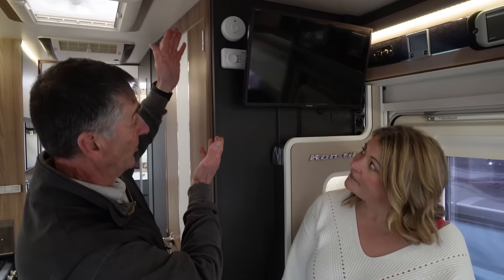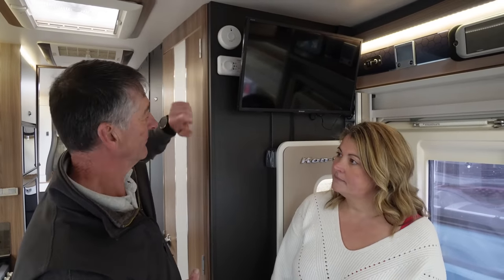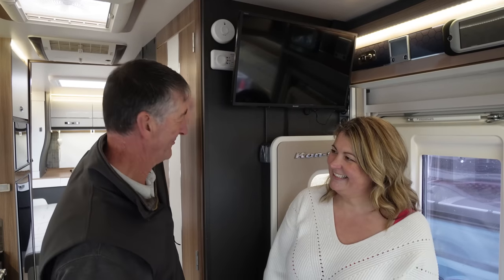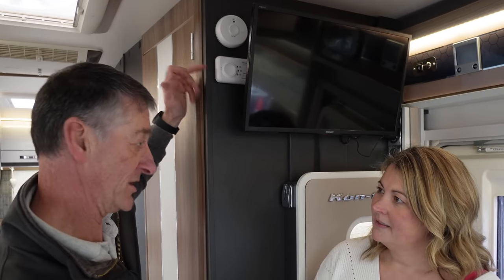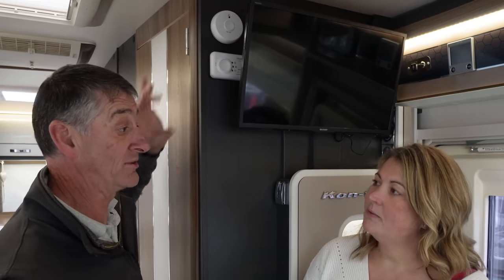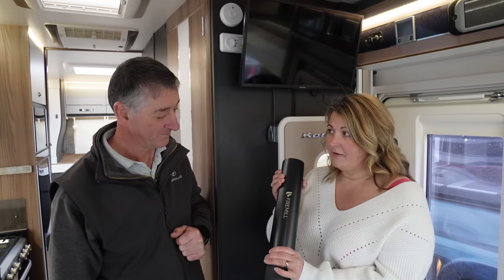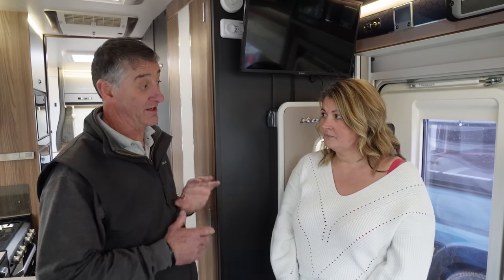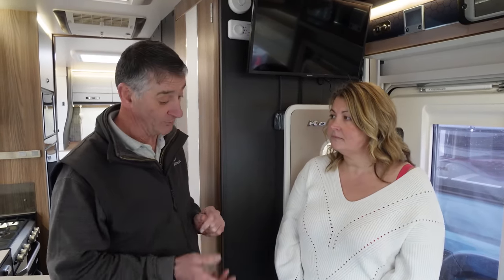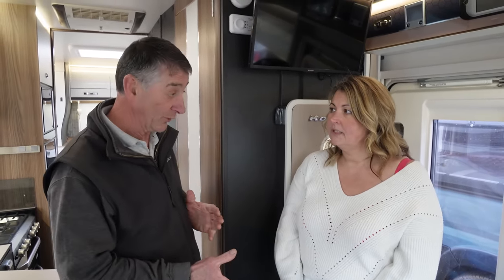The last element is fire and safety. We start with the carbon monoxide detector and the smoke detector — you'll often hear these go off on sites. We test them using the test buttons. For the smoke detector we change the battery, but the carbon monoxide detector is a throwaway item — you can't replace the battery, so it's a five-year product that's then replaced entirely. If there's a fire extinguisher fitted as an aftermarket item, we check to make sure it's still in date, as they are date stamped.